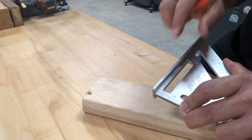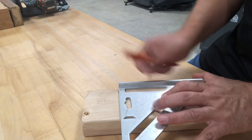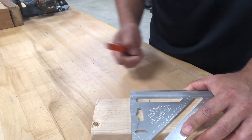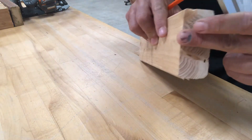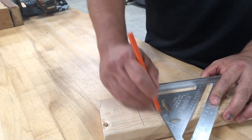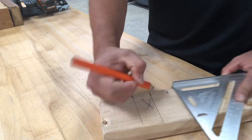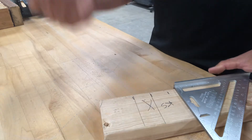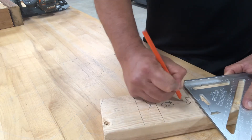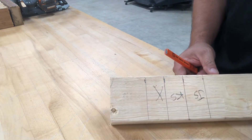The top slot also has marks from 1 inch to 4 inches. If you need to scribe a line or lay out two-by-fours when framing a wall, you can use those as a reference. Typically a 2x4 will measure an inch and a half on edge, so you can lay out your regular stud. If you're framing a door or window, you go inch and a half increments for your cripples, trimmers, and jack studs — it's a quick reference instead of pulling out your measuring tape for every stud.